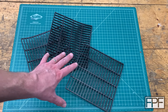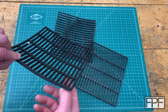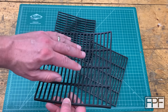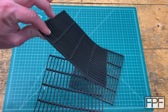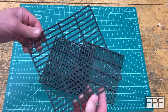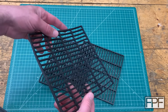What I've actually got here on the bench is one that I would consider kind of a fail - well, not really, but you'll see what I mean. This guy did not start out curved like this - it was flat. I made these for my wife for underneath the tomato plants in our garden last summer. The plants were drooping down and the tomatoes were resting on the soil - we didn't want them to rot - so I printed up three of these and put them underneath the tomatoes. They definitely warped in the sun. This was plain old Sunlu PLA, and on a hot day, or probably over the course of a couple of hot days, these guys warped pretty bad.